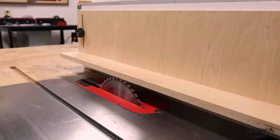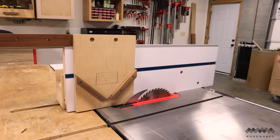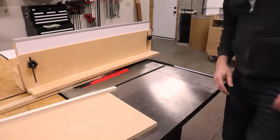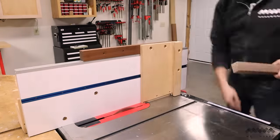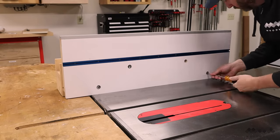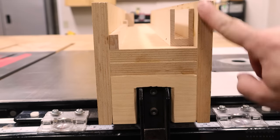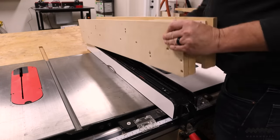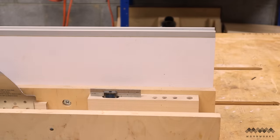Already, I've made spline cutting jigs, an L-fence, and a tenoning jig. A spline cutting jig helps you make cuts to strengthen the corners of miter joints. An L-fence can be used to make all kinds of random, odd, angled cuts on a table saw. And a tenoning jig helps you make tenons — for instance, when making frame and panel doors. This tall fence can be bolted to either side, so you can use it on either side of the blade. You can make an auxiliary fence to fit any make or model saw, so long as it has a sturdy rip fence to reference off of, and it doesn't take much plywood to get started. I have a whole video showing the specifics of this fence, as well as plans for you to build your own — links are down in the description.